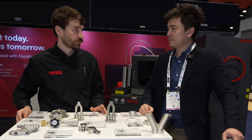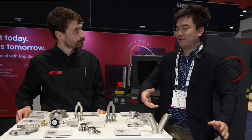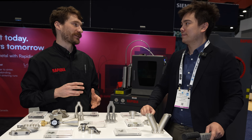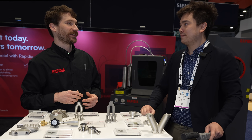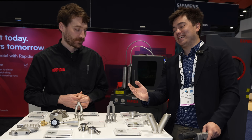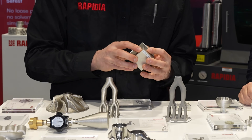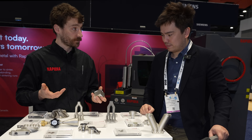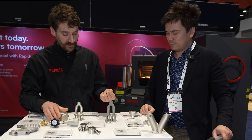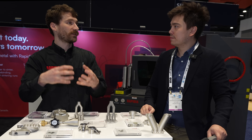There are a lot of parallels with ceramics and any sort of bound metal and sinter-based metal process. We've tried throwing the paste on a potter's wheel — the consistency of our metal paste is a little bit different than ceramic, and because of the density, any angle just collapses under its own weight. Another way of green finishing is with water: since we're using a water-based paste, you can use a slightly wet brush to smooth it. Or you can wet two surfaces and stick them together, and if you sinter afterwards they are fully fused — fully welded together.